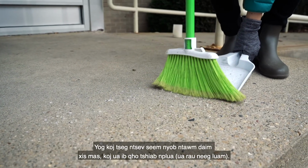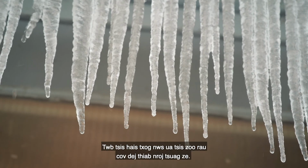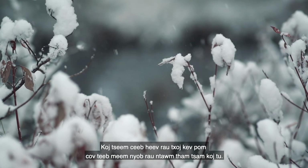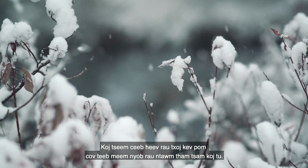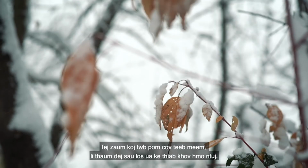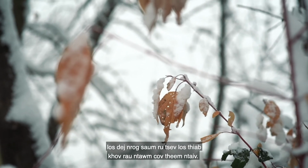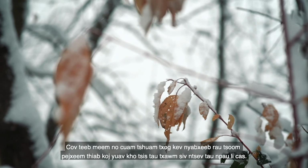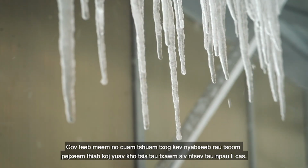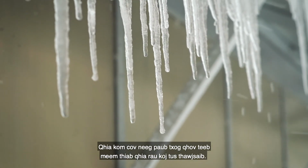If you leave extra salt on the concrete, you now have a new slippery situation, not to mention harming the water and nearby vegetation. You are very important in noticing problems in your maintenance area. You might notice problems like a dip in the sidewalk, where water collects and freezes every night, or water dripping from a roof and freezing on the steps. These are hazards for public safety, and you can't fix them no matter how much salt you use. Make others aware of the problem and report them to your supervisor.